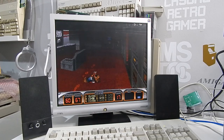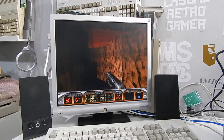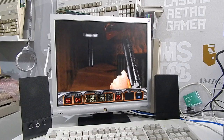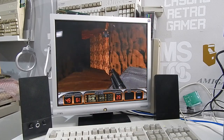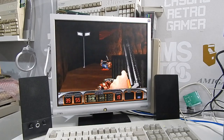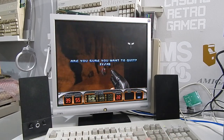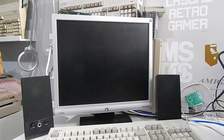So, you know, it is very possible that if we swapped out the memory sticks in here for maybe slightly better RAM, that might solve the issue. We could get that wait state back down to 0 and get the full performance possible out of this system. Just out of interest though, if we run SysSpeed again, let's just see what the performance is now with that wait state back to 1.